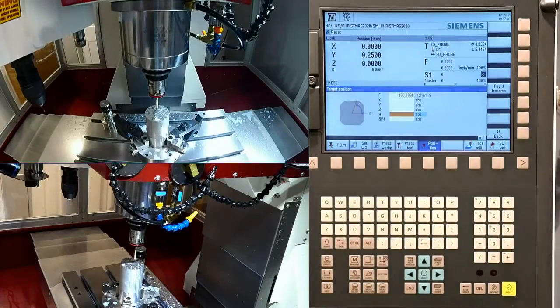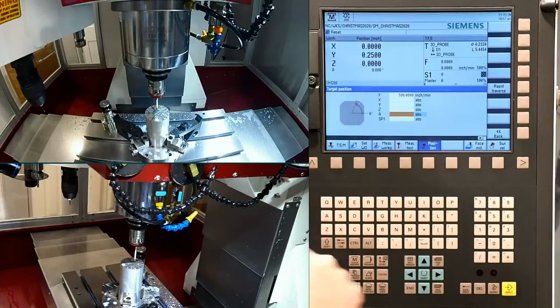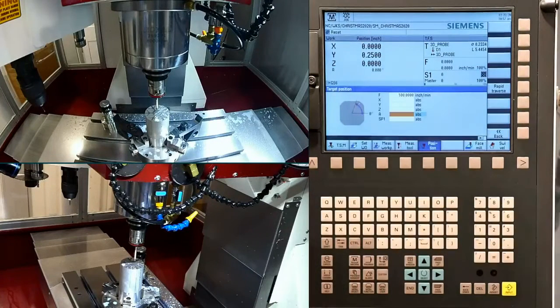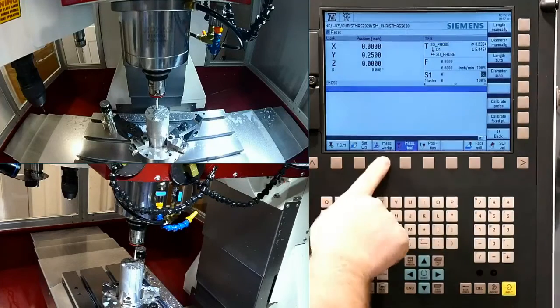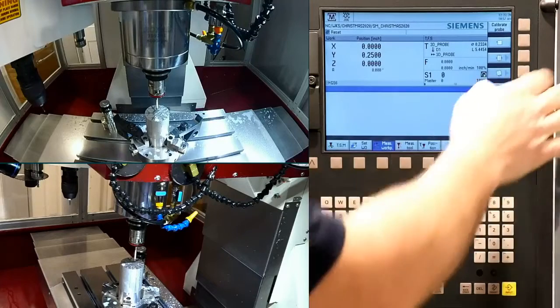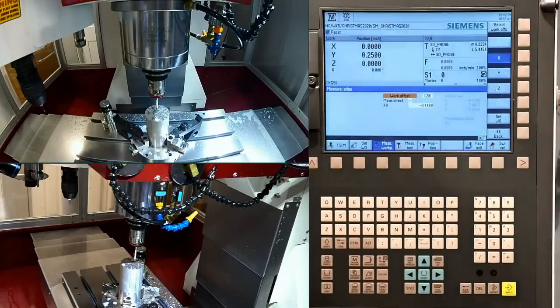So we're going to do something unique here. We're going to use a slitting saw to part off the part. We're also going to put a slot feature in this part. But if you don't have access to a slitting saw, I actually haven't had one till just recently, then you may want to move it before you get to those final operations over to a lathe, and you can just use a 62 thou wide grooving tool to slit your part or to part it off.